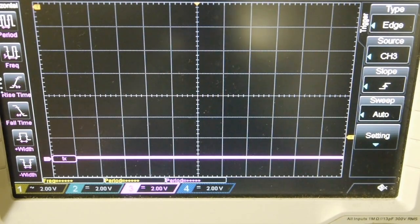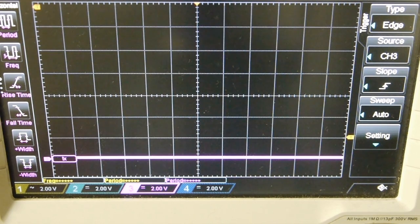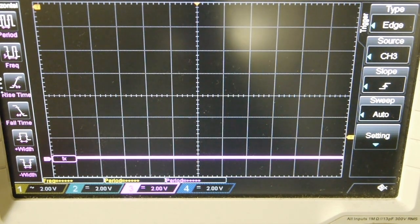Okay, so I've resoldered that pin, and it was definitely, well, I'd say about a millimetre too far out of the connector block. I'll go through connector blocks in a minute. So if I go to VBAT now, I do get the VBAT signal. So I think there was a problem there.